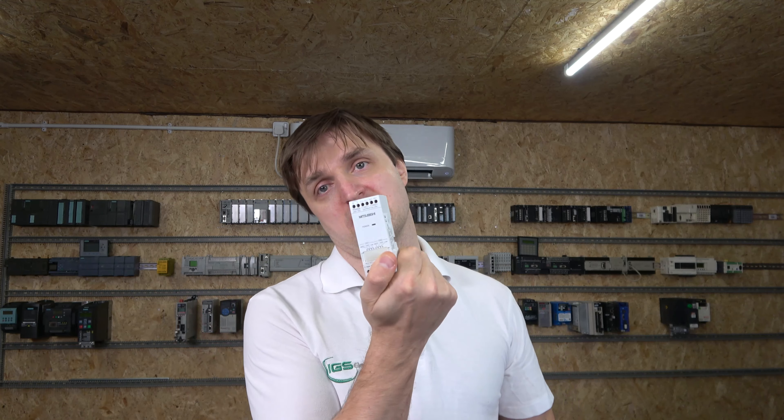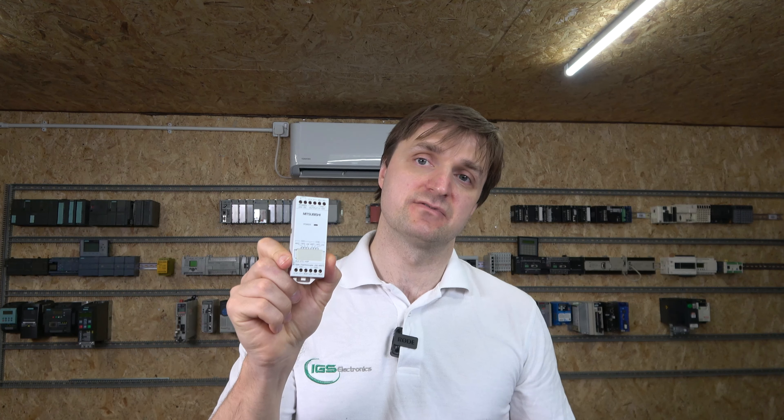It's got a lot of additional cards that you can have, but to give you a good principle of how that works, I'll be using these. The analog inputs for these controllers are 0 to 10 volts and it pretty much automatically works as soon as it detects the voltage. As soon as the voltage goes past about 15 volts it's treated as a digital input, and if it's within 0 to 10 volts it will see that as an analog input. It reads that as a value transferred into the controller, and with these cards it will take the reading from our temperature probes, convert that into 0 to 10 volts and transfer that data into the controller as a temperature reading by scaling it for that specific thermocouple.